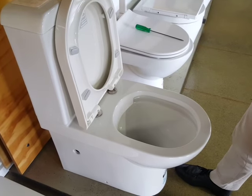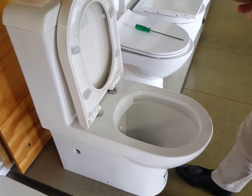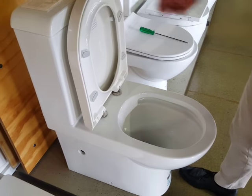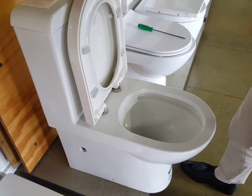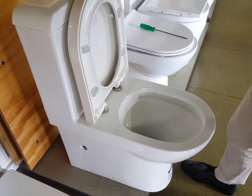The reason the seat might be loose in the first place is that it either hasn't been tightened in the first instance when it was being installed, or just over time with a lot of use it can loosen, or thirdly if it's been installed and the screws have been screwed down with a power screwdriver, it is possible that these threads have been stripped on the nylon bush.